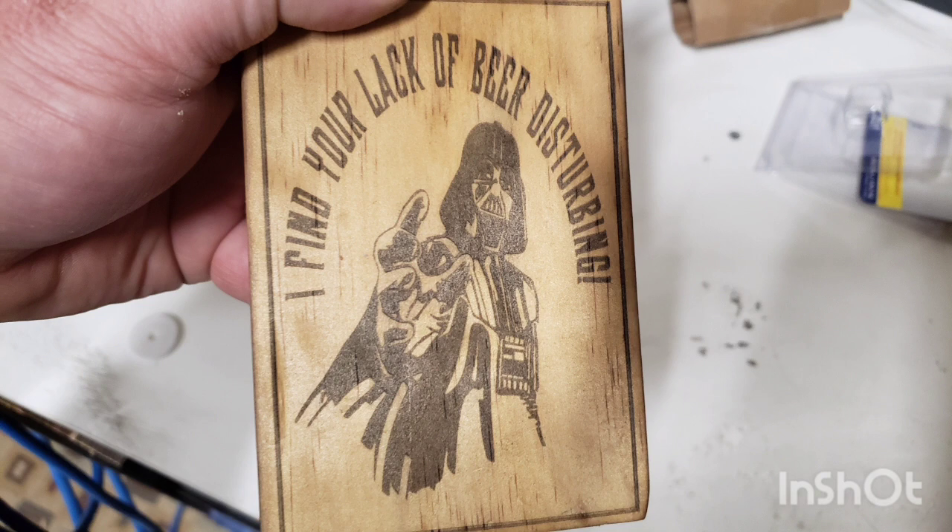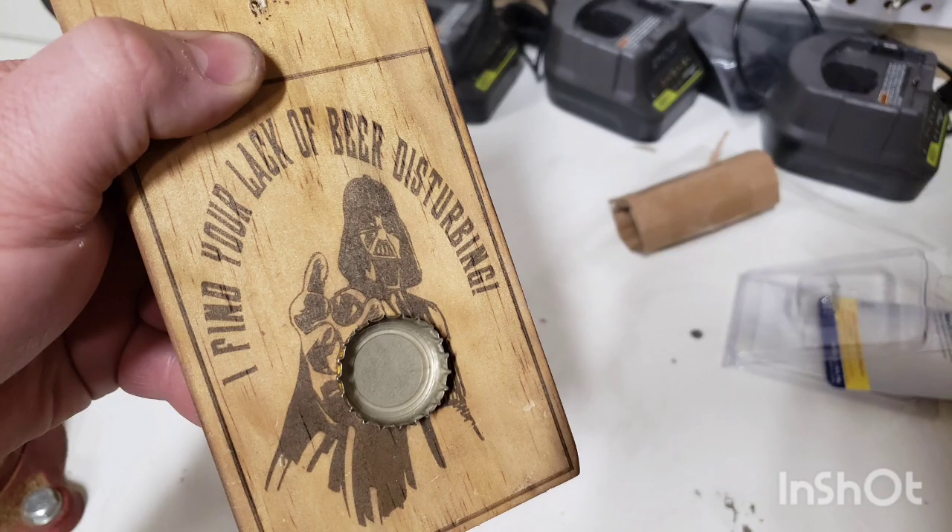It's a pretty simple project. I've seen these going for sale on Etsy from twenty dollars for simple stuff to thirty or maybe forty dollars for more custom order pieces. Your bare cost into this is probably under ten dollars depending on what you can get magnets for in your area, whether you're using the three-point or four-point design, and how big of a catch magnet you want to use. I don't think you'd want to go much smaller than the 30 millimeter I used — the smaller it gets, the more chance it's not going to catch the bottle cap. Put a little extra money into it and make sure you get a magnet big enough to catch that bottle cap. Well, I hope you enjoyed it — thanks for watching and I'll see you on the next video.